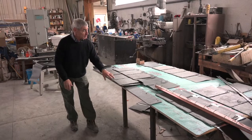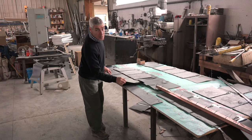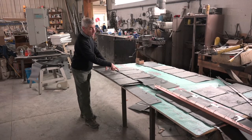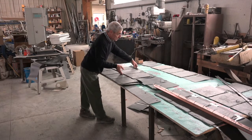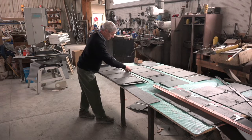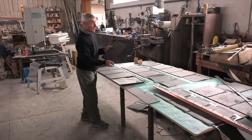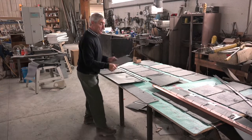Now we have the same basic slates — again with an under eave and a layer of HDPE, then your slates. We're using a 14 inch slate so we can nail up higher, and then we can start with our traditional either slate shield or mansion slate. We have a layer of hooks and our 14 inch slates which are punched high. Taking it apart this way, the first thing that goes down would be your 14 by 10 slates.